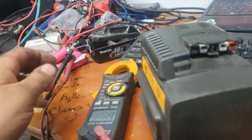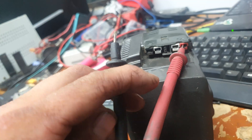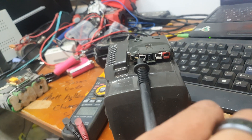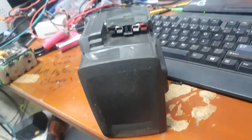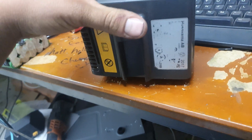I tested it across our two terminals here, which are kindly marked positive and negative — which is great. 39 volts. Nothing wrong with this 36 volt battery, so the cells inside here — almost goes as a given — are going to be fine.